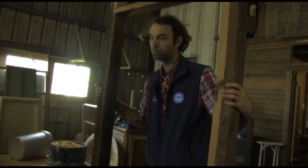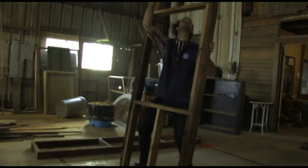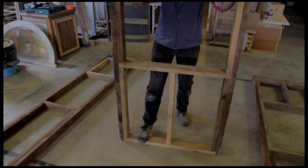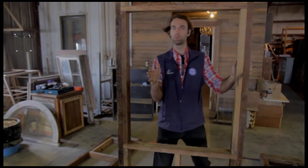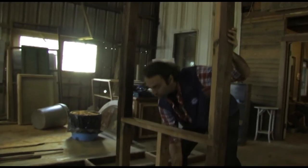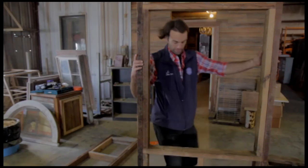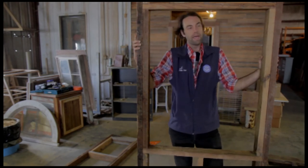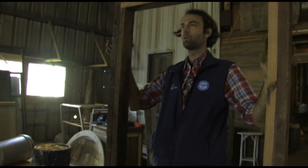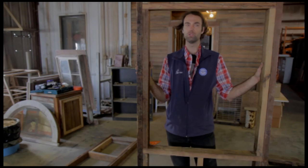This gives the advantage I was talking about in SketchUp - when we attach this to the wall we only use two screws at the bottom and two screws at the top. We tilt all four walls up, and if we decide a window isn't quite in the right place, all we need to do is unscrew those four screws and slide it along almost like it's in a track, then re-screw it in place. This came about because once you get in the space you perceive it differently and think 'six more inches over there would be nice' - it's a huge advantage when framing.